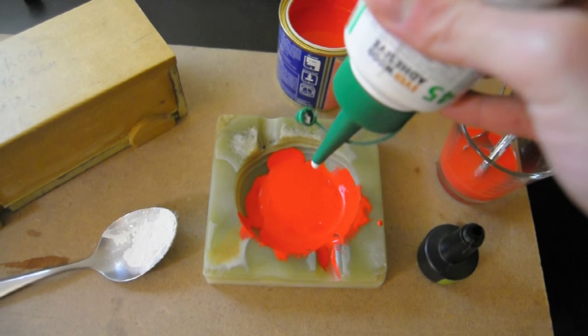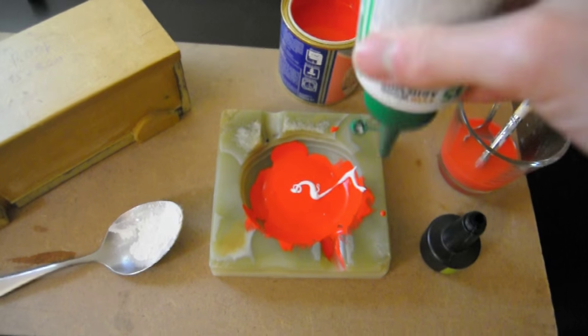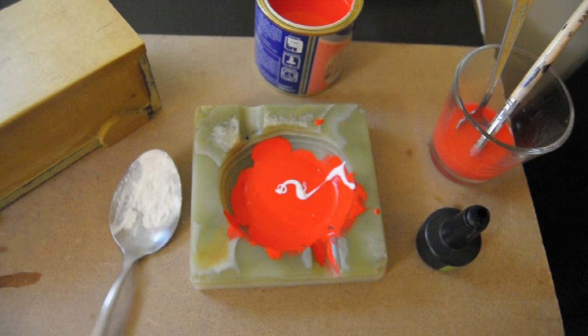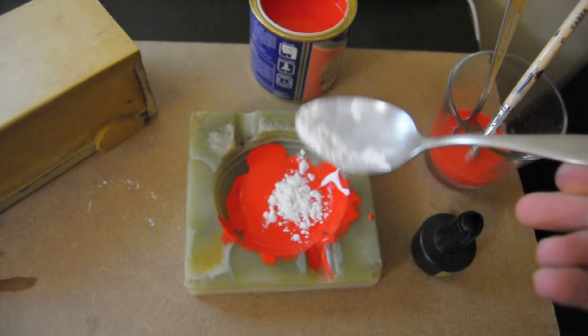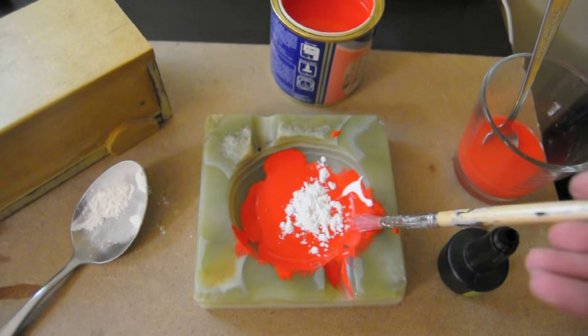For the paint, I've used water-based emulsion paint. To make it hold better, I added wood glue as PVA resin, then a little bit of acrylic wall putty, which is calcium carbonate powder with white cement. This will cover any imperfections better and make it look smooth like silk.